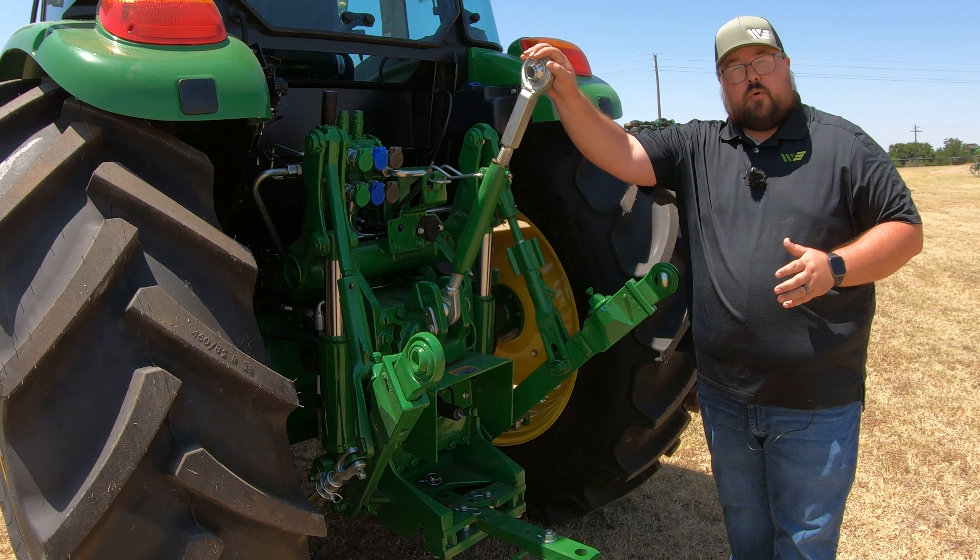You do have your PTO shaft down here at the bottom that is going to put out 115 horsepower. Keep in mind, this is going to be reversible — there's a snap ring right in here that you can take off and flip the PTO shaft around to go from a 540 to a 1000. So depending on what machine you are going to be pulling, just know that you have the option of running either 540 or 1000. And right below that, you're also going to have an adjustable drawbar that adjusts in and out or side to side, depending on what you're pulling.